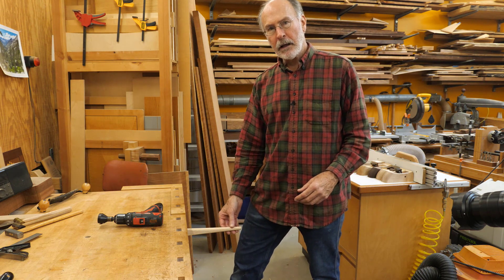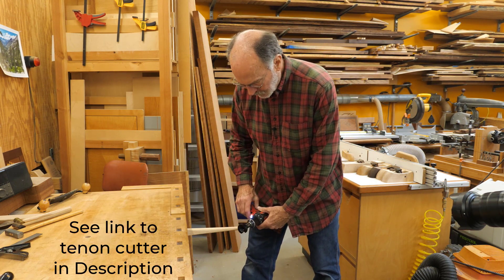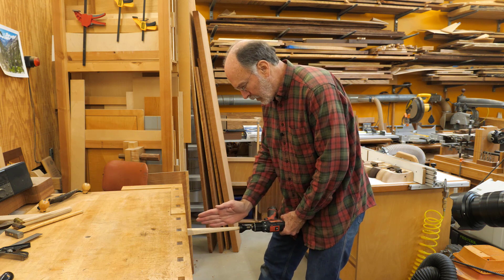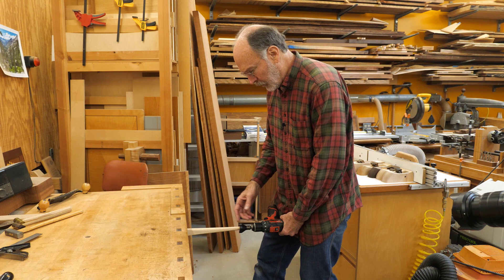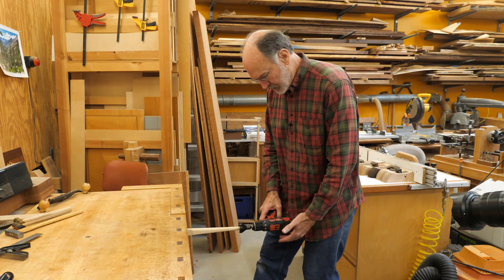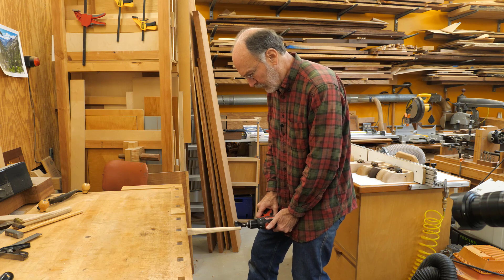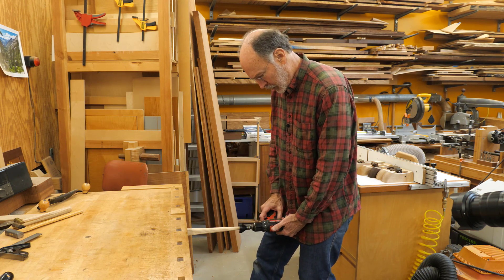Next up, I need to create the tenon on the end of the handle. I've got it clamped in a vise horizontally. The tenon cutter goes in a drill and I'm going to spin the drill fast and just push this on. It's really important that I get this parallel to the handle. I can see alignment this way, but I can't see the other way. You really can't do this by yourself — you want to get another person looking from the side to tell you where you're at. I'm also going to hold my hand up against my leg so that as I push, I'm more likely to keep it horizontal. I've got my wife off camera — she's going to tell me if I'm okay.